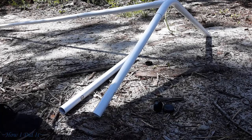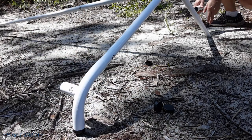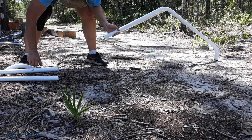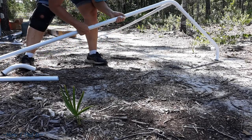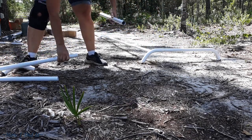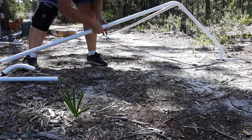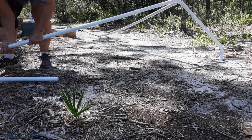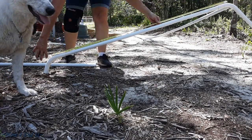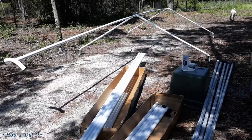You'll see I assembled it how they were shown in the directions, but that is just way too small of a gable span. So here I disassembled it, and then I was like, oh wait a minute — I want the holes to line up so it makes it easy, because I'll later put in self-tapping sheet metal screws to hold all this together. Here you'll see I go ahead and assemble it and give it a quick measure, and now I have my span that I need to get my 10-foot width by my 20-foot length.